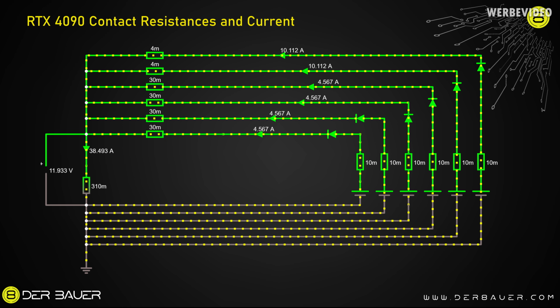This is a result of having different resistances, for example for the cable and also for the contact resistance of the connector itself. And then you could, for example, have 4 pins or 4 wires with a rather high contact or wire resistance, which is causing them to carry less current. And then the remaining 2 wires and remaining 2 connections would carry a lot more current. And the card has no idea of what is going on, which can cause higher temperatures.